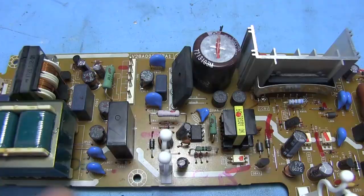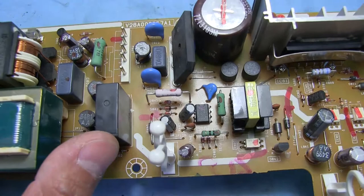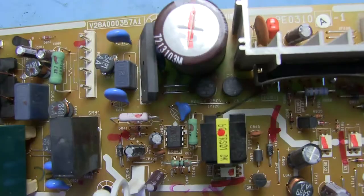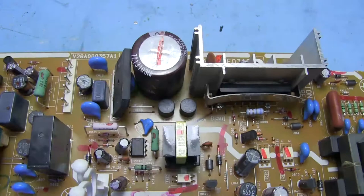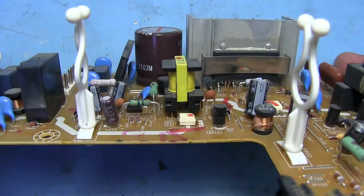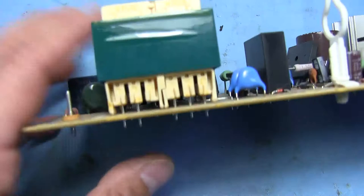Let's move on to the power supply — the main system power supply. We've got our input, some filtering stuff here. This relay here I think is probably the one that does the power switching for the ballast board for the lamp. We've got a full bridge rectifier right there, and our big filter cap for that. This here is probably our main controller with built-in drivers. I want to see what this component actually is, because it looks like a filter but I think it might actually be a transformer. This whole side of the board is really heavy — quite a big chunk of iron. So let's flip it over and see what we have.